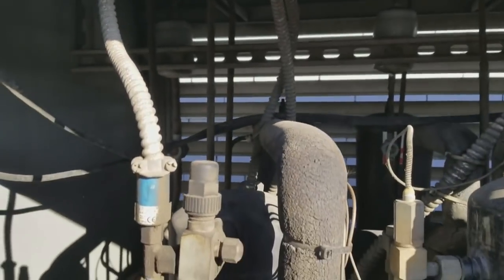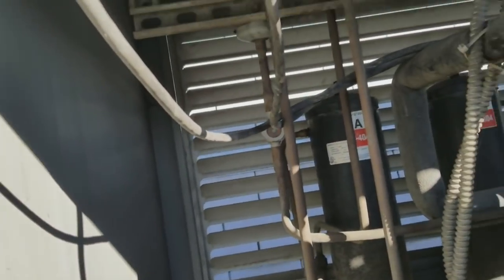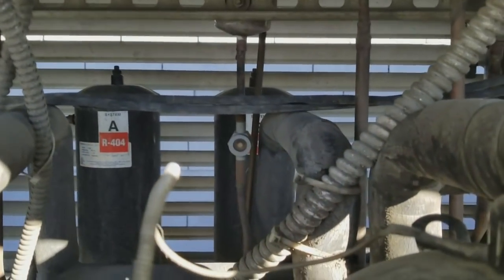It's also good when you've had the rack shut off for a little while. It's a good time to come through and check sight glasses, because more than likely everything's going to be running. So I may not be here for everything else, but I'm going to come over here, and if they're running, I'm going to check the sight glasses. Like this one's not running yet. This one's running. Got a clear sight glass.